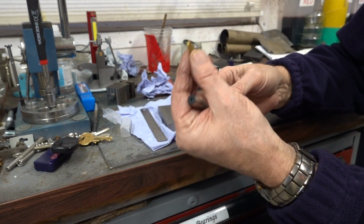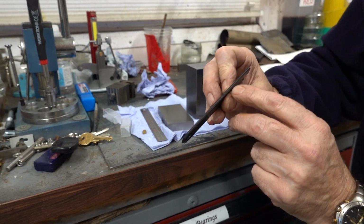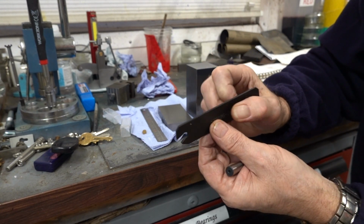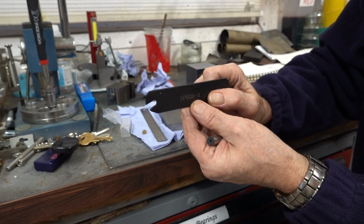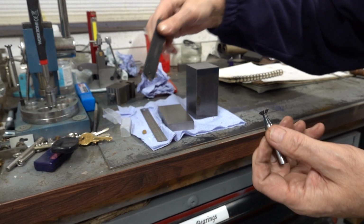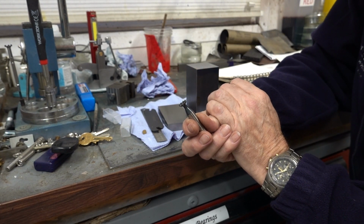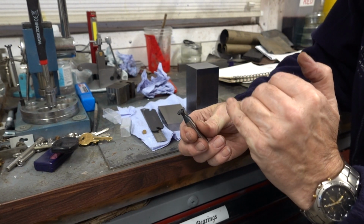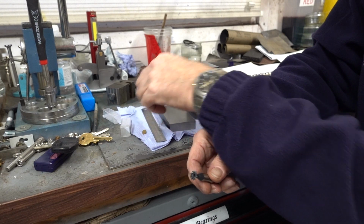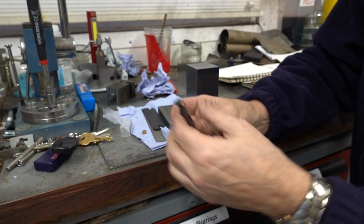Look, that bit's falling out. Because them blades, you won't be able to see it, but they come to a point. They're chamfered on both sides. So if you stuck that into a dovetail edge and shoved it up tight, it'd grip it. And that's what that's for, to make that way. It's either that, or get an HSS milling cutter and grind it to like a gear cutter, because that's actually like a gear cog, what you'd go into a cog, but I don't think it needs it.